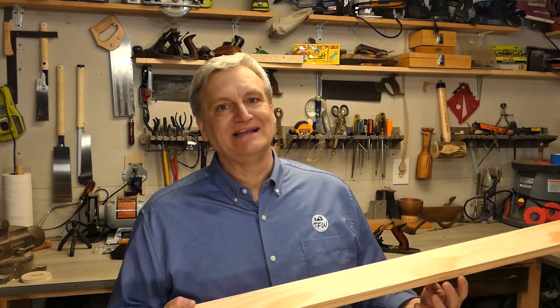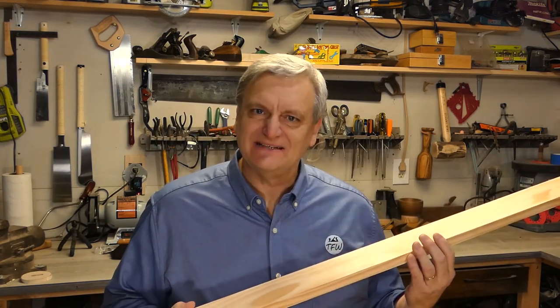So we're going to do a holiday serving tray, and I'm starting with a couple of pieces of select pine — three-quarter inch pine. This is the stuff with no knots, a pretty even grain, and even density. It's actually a little harder than typical soft pine you'd see for construction materials. Each board is about seven dollars, and I'm going to need more than one, but $14 still leaves me a little extra. So I bought a couple of little cabinet or drawer front handles that are going to look really good on the two sides of the serving tray.